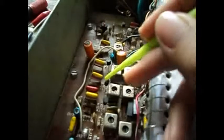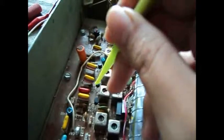And this is the weird one, TR104, which is this guy, which is right before this guy, or right after this guy. TR104, here are the voltages, base, collector, and emitter from before. And here's the voltages now. And it looks like there's a short between collector and base. The same thing's happening on FM. And I checked it, and there does indeed seem to be a short in there. Not quite sure if maybe that's the coil that's in between these two.